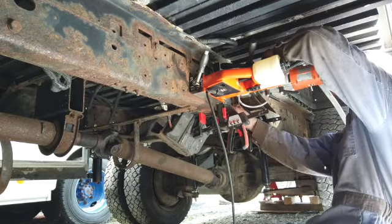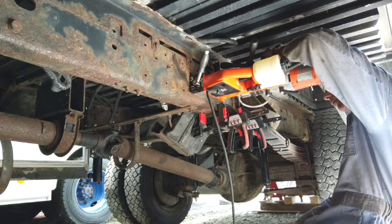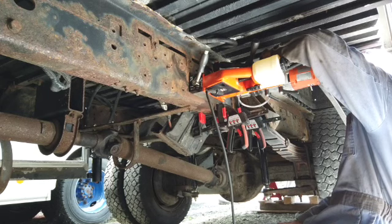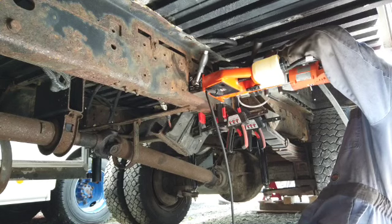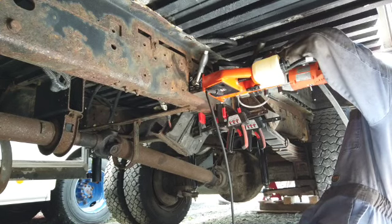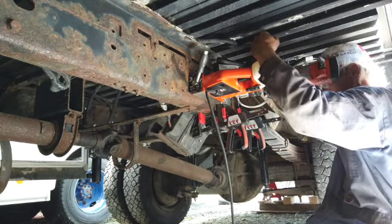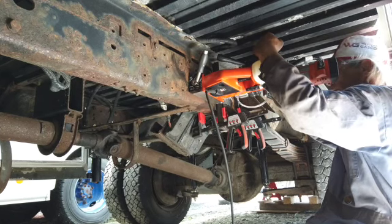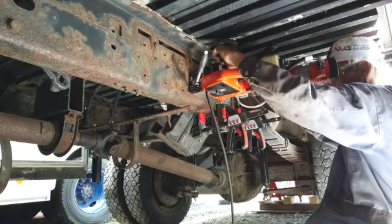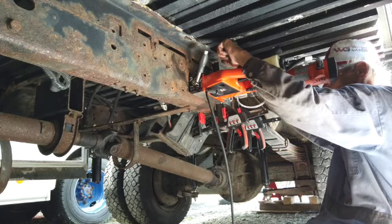It's really important to get the jacks mounted straight up and down. You don't want them to go left or right. Any deflection on the cylinder will wear out the seals prematurely and put extra stress on the jacks. You see, I take a lot of measurements to make sure I'm perfectly square. Cylinders will come down perfectly square. These jacks at the back, I think, end up about 1 inch lower than the ones at the front because I had to deal with being underneath the floor.